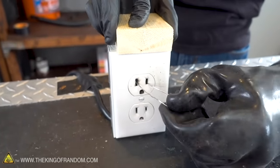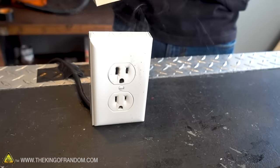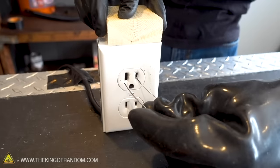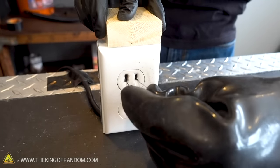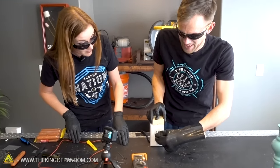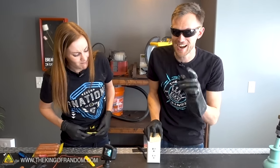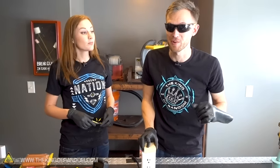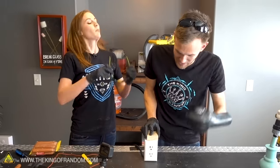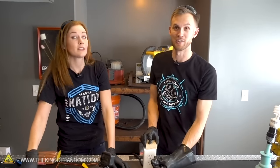Well, definitely got a lot of sparks out of that. Got a lot more sparks out of it — that's staying very connected. All the lights just turned off. So we had lights plugged in all around the studio, and that second time there where it sparked, they all turned off. So I'm pretty sure that means we've now tripped the breaker, which is what we were hoping would happen. That's what the breaker is designed for. You can see now this is still in there and nothing's happening — no more sparks, it's not hot, and all the lights are off. So we need to find the circuit breaker.